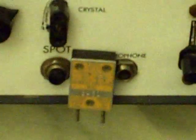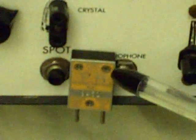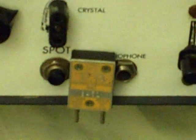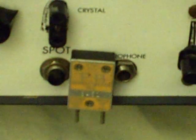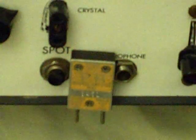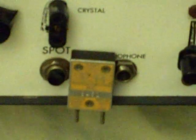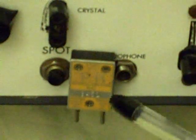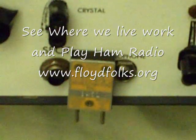You could plug in different crystals. Here's the plug-in socket for the crystal, and here's the crystal out of its socket. The piezoelectric crystal is basically a quartz crystal. If you warp the crystal a little bit, it produces a voltage. If you put it across a tuned circuit and apply a voltage, it will oscillate at a very stable frequency. So it was used to determine the frequency of the transmitter — it's an electromechanical device.